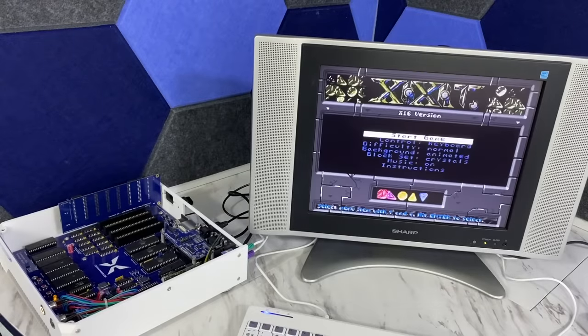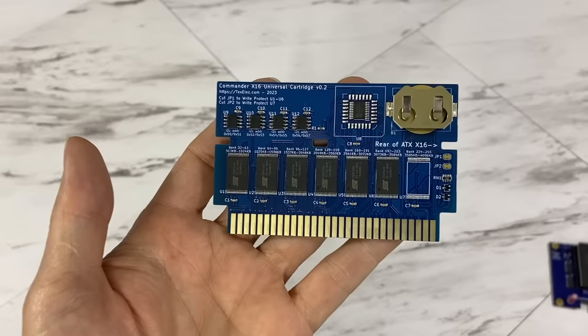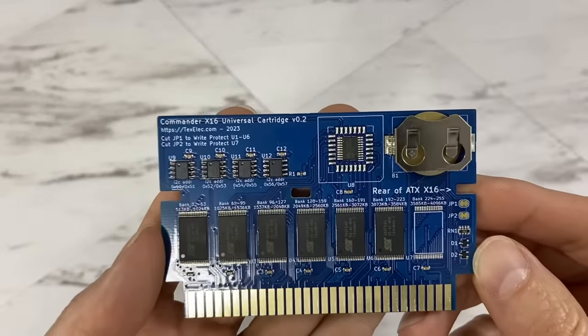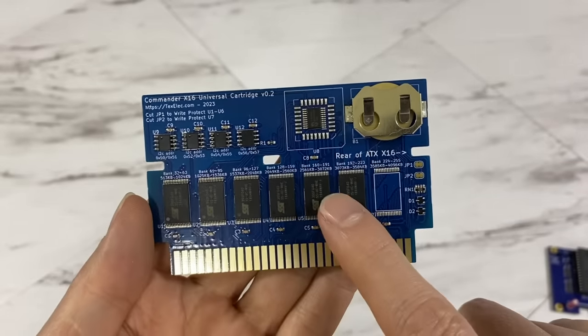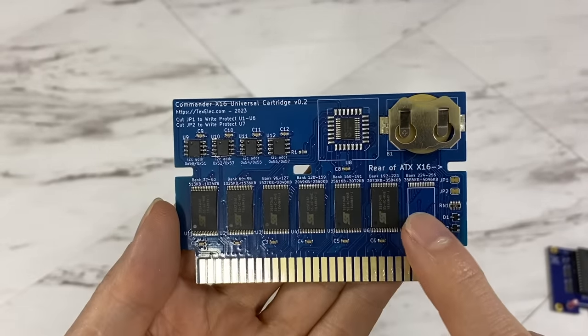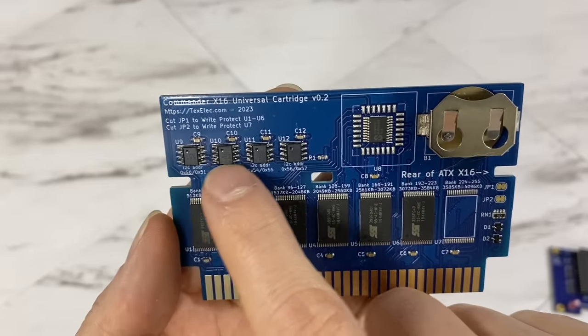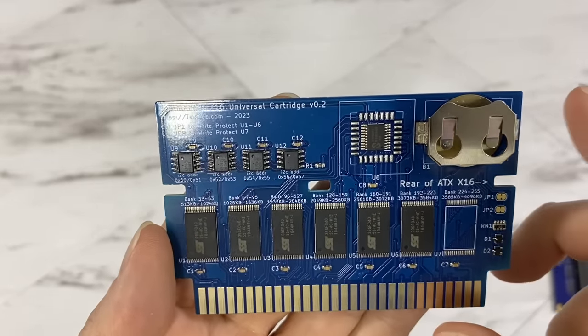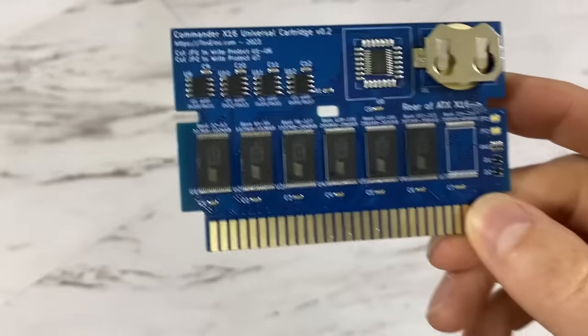Of course, this board was only designed for game development, so we need something smaller for the final product. So we've condensed this down to a smaller surface mount version that does exactly the same thing. Now here I have 6 flash chips and a space for one more. And we've added the option to have up to 4 of these 64K serial flash chips, so that's 256K there. And of course the idea is you would only populate whatever parts your particular game or software needs.